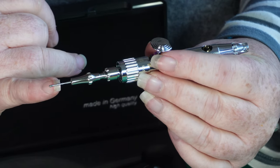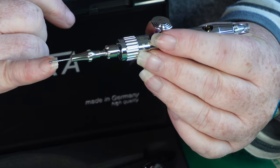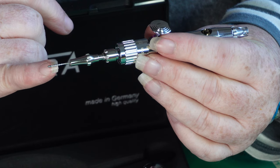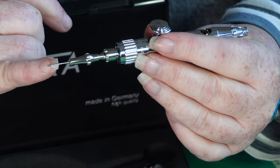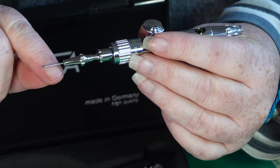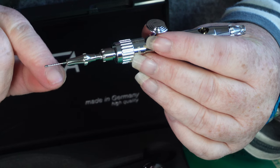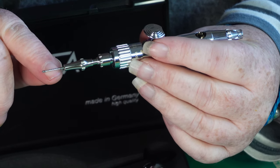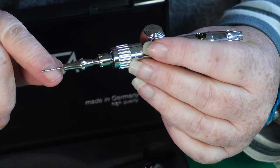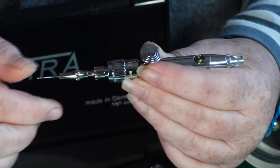If we take the back off — they've still got on the needle, this is actually the back of the needle — it's a 0.45, but essentially a 0.4 needle, and they have four ridges, and that tells you the size of the needle. They also do a 0.2 which just has two ridges. That's the standard indicator so you know which size needle you've got.